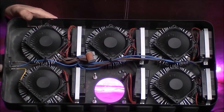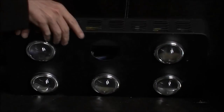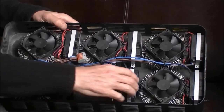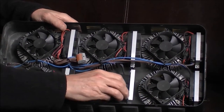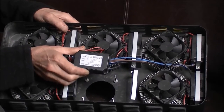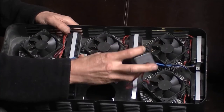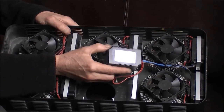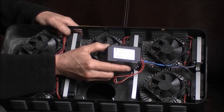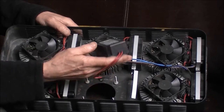Those fans are 12-volt fans, and each one of those LED units is a 72-volt DC unit. Each of these power supplies has a 12-volt tap and the 72-volt supply for the main LED. Our replacement bulbs are going to be 36-volt, so we're going to need to join our bulbs up in series to cater for the additional voltage.